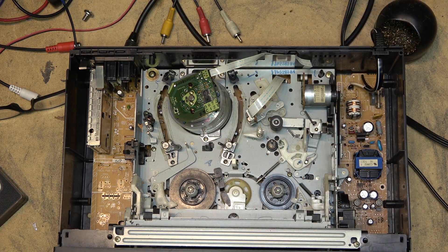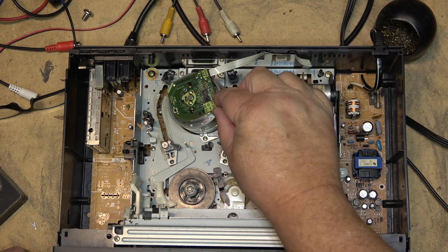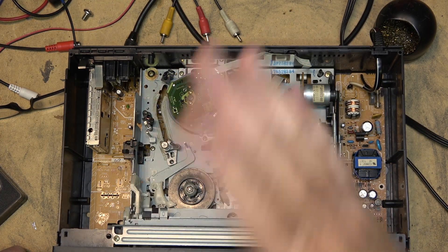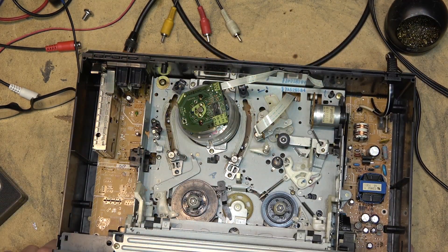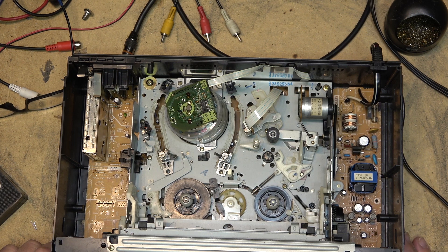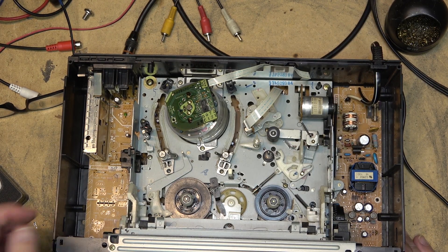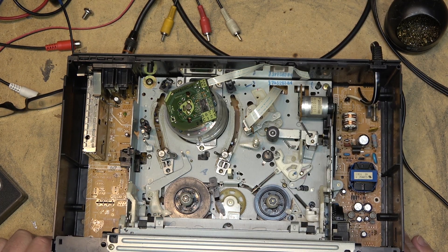By changing the alignment, which is exactly what JVC did on their dynamic drum — they actually had a servo that tilted the drum ever so slightly. We've done videos on that. Those machines are all junk; every single one of those machines needs to have that circuitry disabled and an emulator put in place. The emulator generates the pulses that are normally generated when the machine does a self test, and if it doesn't see those pulses when changing mode, it shuts down and the machine is useless.